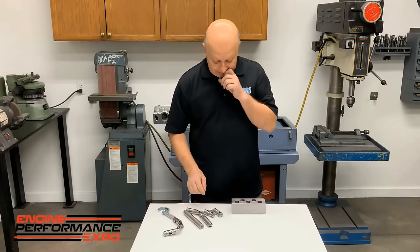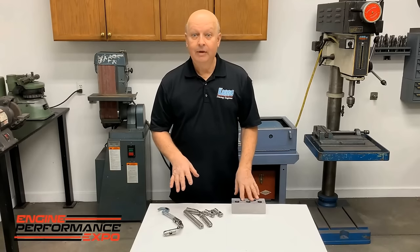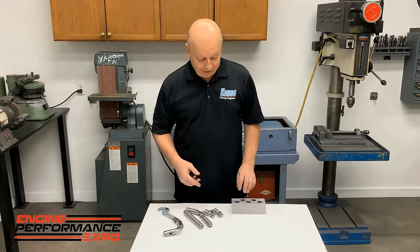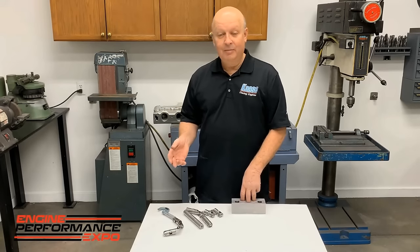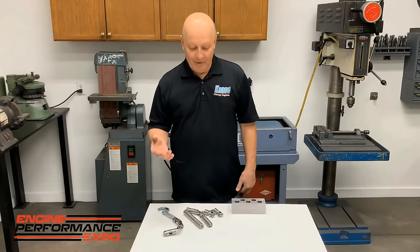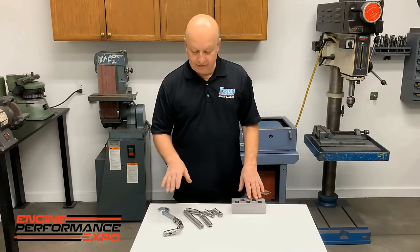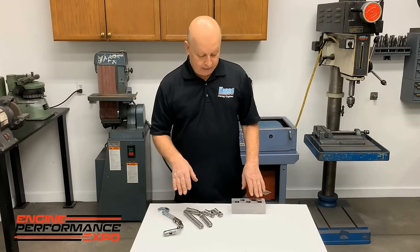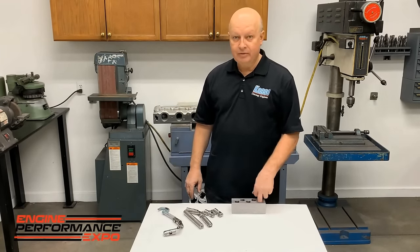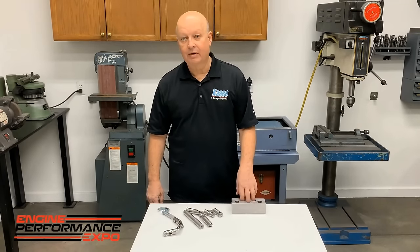And the problem is, you can have 1 thou clearance with lifters, and it's going to go in, but it's not going to live. It'll seize up right away. It's like my one guy, Ron Baker, who works here, he says, if it's a little bit loose, nobody will know. If it's a little bit tight, everybody knows, because it blows up. So we are very good about making sure that these things have enough clearance. But the big thing is how you measure it. So this has really helped us measure the lifter, make sure everything works right, and it's got at least 1 3/4 of clearance.